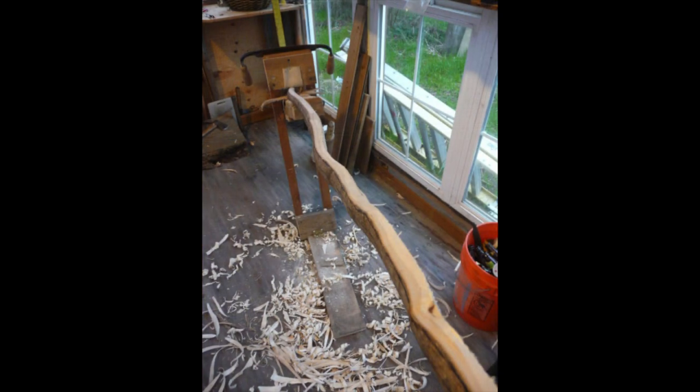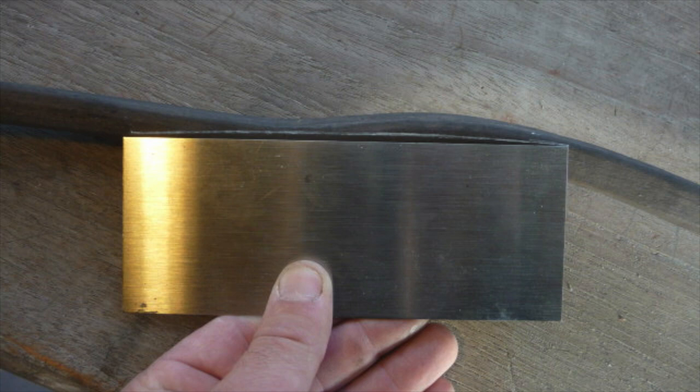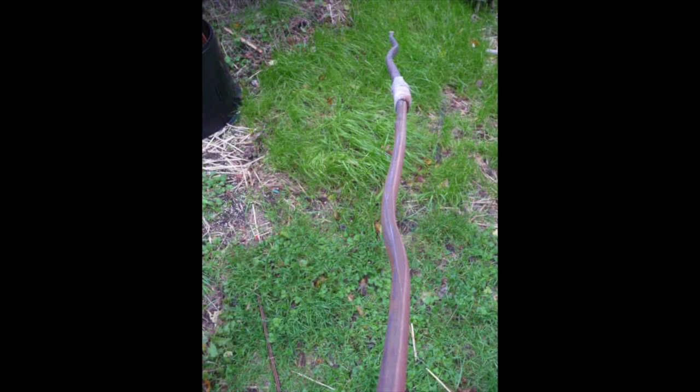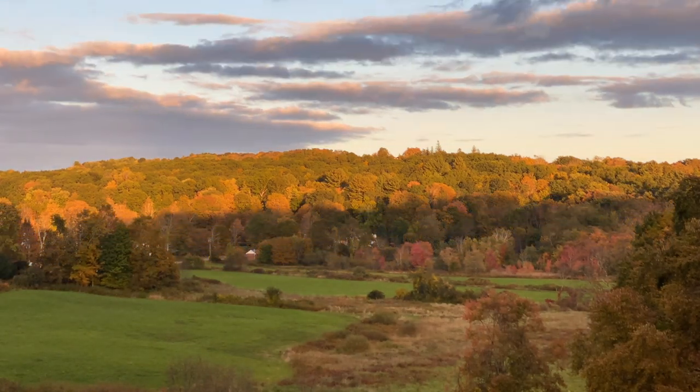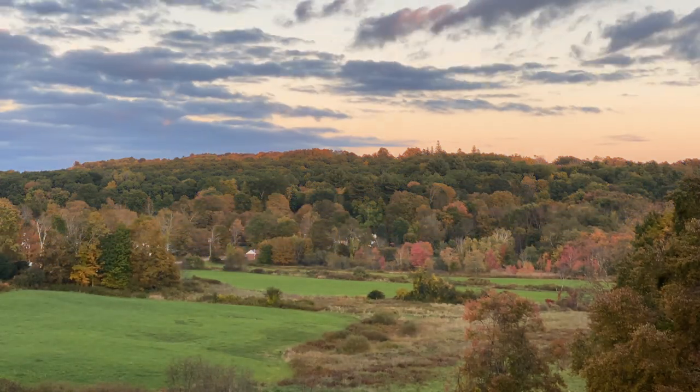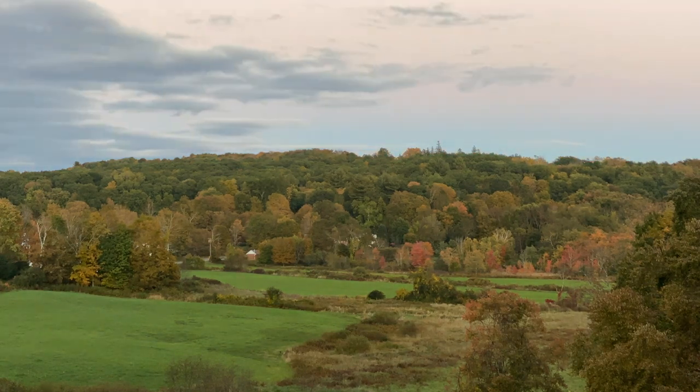When you brace the bow, you can hold the straight edge against these lines to see how much that portion is bending. This will make it much more obvious which areas of the bow are stiff and which ones are bending more. Derek Hutchinson has a similar trick which he covers in his excellent YouTube channel, Del Cat. Once again, the link to the method is in the description. Since I've never used it myself, I won't cover it here, but I think it's a very clever trick, and you may want to try it out.